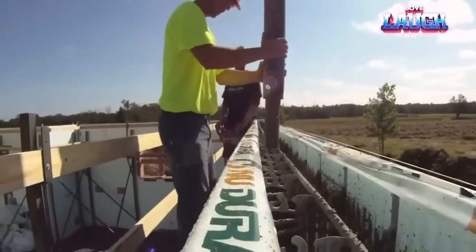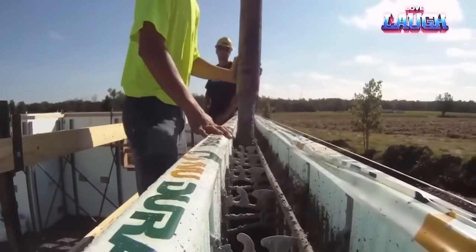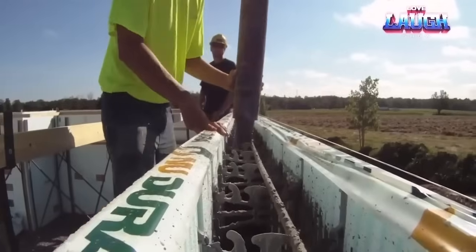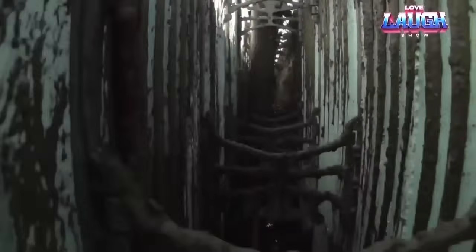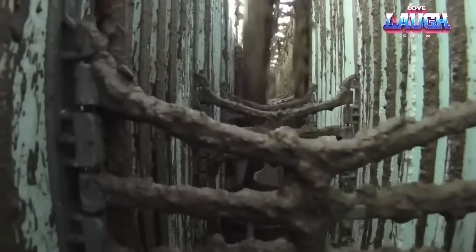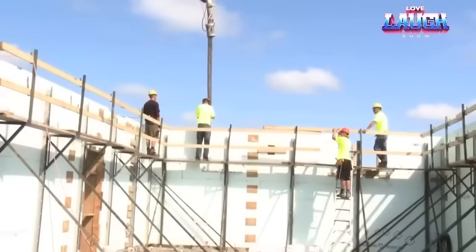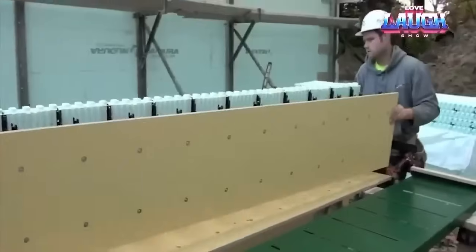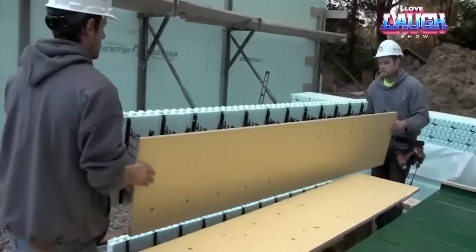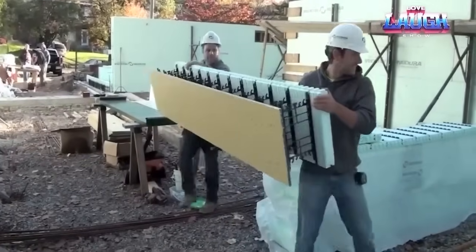The secret lies in the use of special fixed formwork. It is assembled from individual elements, again on the principle of a constructor set. Each element is two panels of polystyrene foam, connected to each other by a reinforcing frame and universal screed. First of all, the choice in favor of this technology speeds up construction work. Installation of polystyrene foam molds takes less time and effort, as the material is much lighter than wood, which is usually used to make such molds.